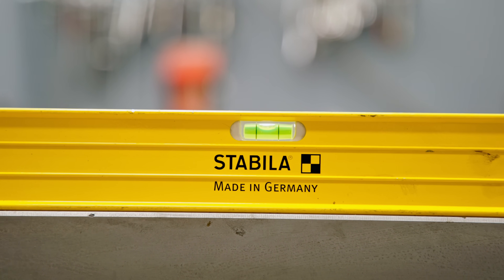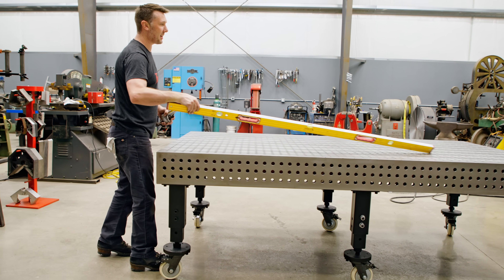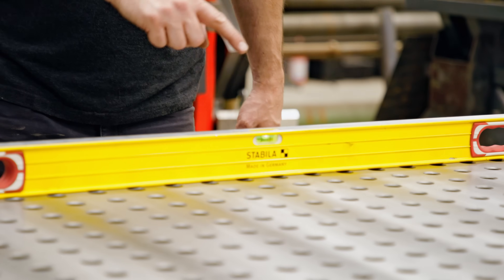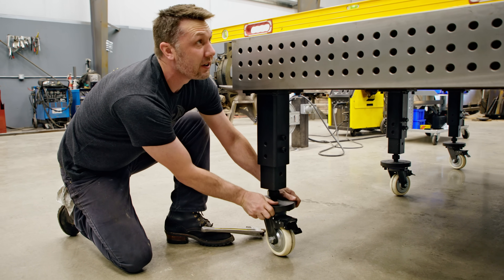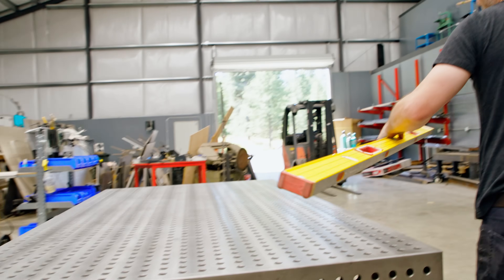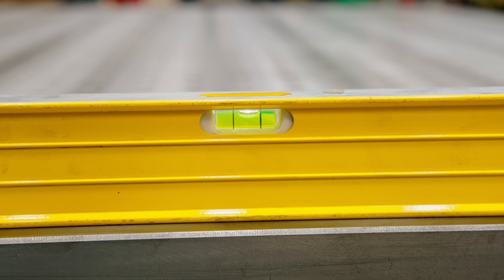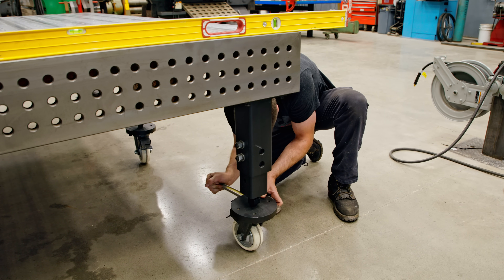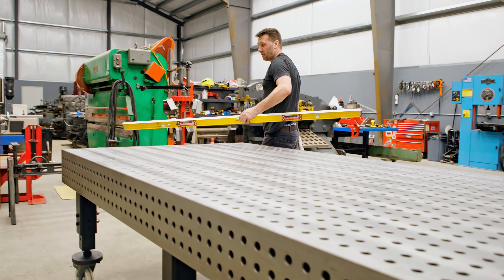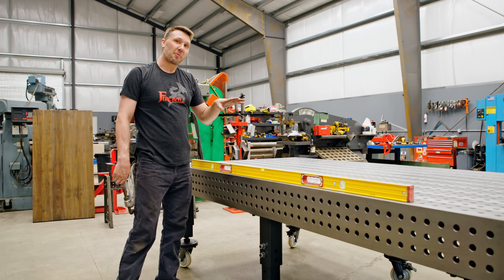Now that we have that, we're going to pick one corner and make an L shape. We know that this side is level — now we want the adjacent side to be level too. I like to give the level a little slide just to make sure there's nothing underneath it. I can see that this corner is high, so we're going to drop it down while watching the bubble. Theoretically the other side shouldn't have moved. Now all we have to do is worry about this last corner — this side needs to come down. Theoretically the side between these two should also be level.